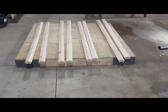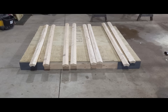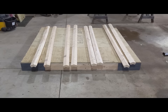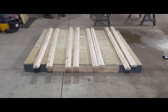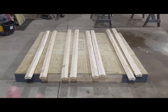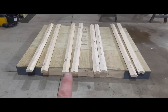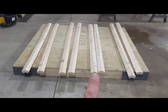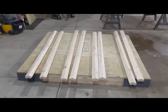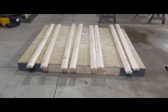These here are the corner studs — we'll need eight of them. Rather than go to the lumber yard and dig through a pile of crooked eight-footers, I decided to buy 14-footers and cut them in half, since all of these are going to be under seven feet. Out of these eight, we have four different lengths: the shortest two are 77 inches, the next two are 78 and a quarter inches, then two at 82 and three-quarters, and the longest are 83 and five-eighths.